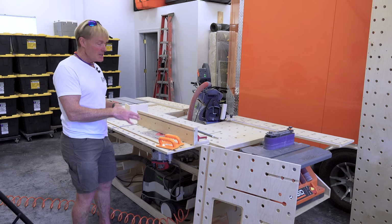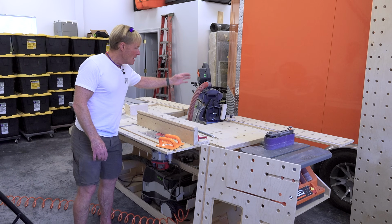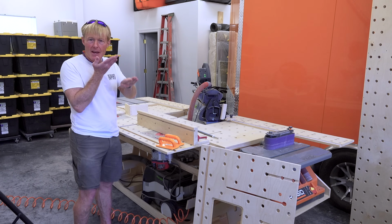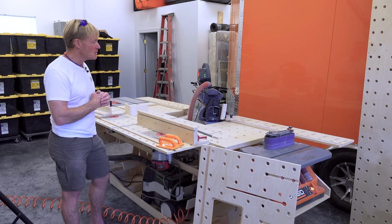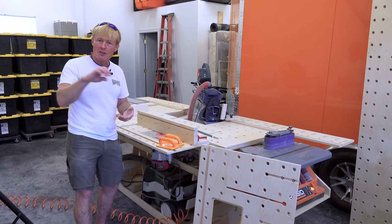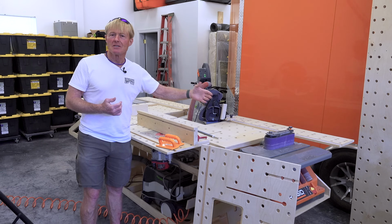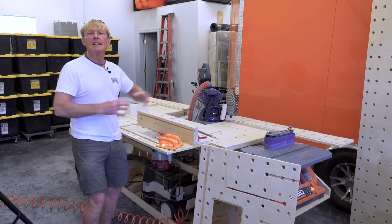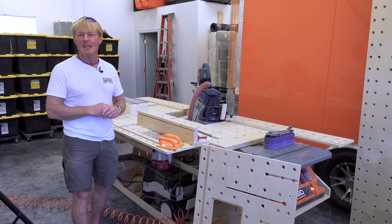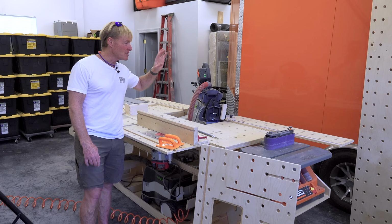Now with things on top, expanding the use without making it big and clunky, without making it heavier, I was able to put the extensions on in a single piece and not have to embed them into the bench like the two total stations were. So now I have my extensions in a single piece, so I don't have to have the T-track butted up and the slide go through. And also, I realized that I only need the shorter extensions 80–90% of the time. They do all I need, and so I didn't need those big long extensions on all the time. So I was able to make a long set and a short set. When it's time to put up crown molding or run base molding, put the long ones on. When I'm done with that, put it away, because these will do everything else. My cabinet installs, my hardwood installs, these are all I need.